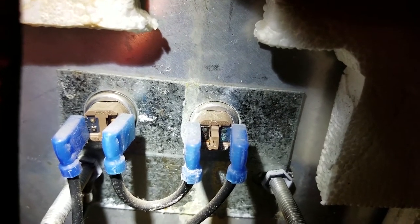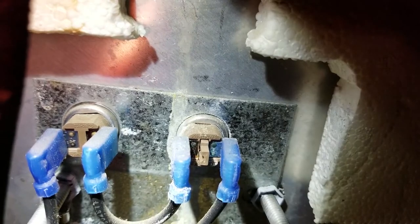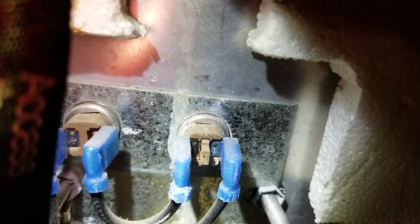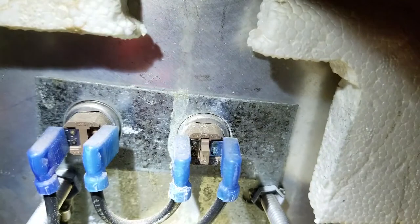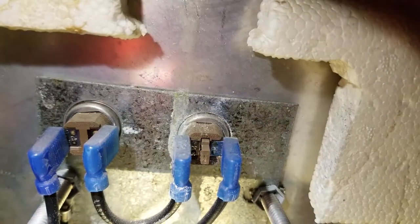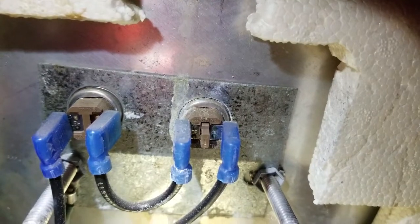You see it makes a little daisy chain. I come over to this guy. Better just stay still here. I come over to the one on the right. He's got that ECO on the front. I don't know what this one's rated for, but the one on the outside is rated for 180. So let's say that this guy here is 180 degrees, but apparently he must have gotten too hot and he tripped. So black comes on the left, goes through the thermostat, daisy chains, goes through the ECO, and then goes down to my heating element.